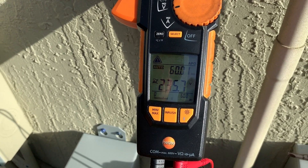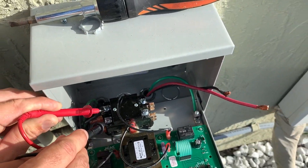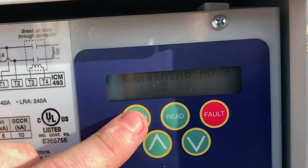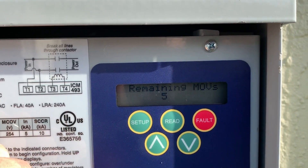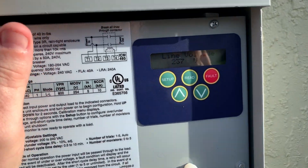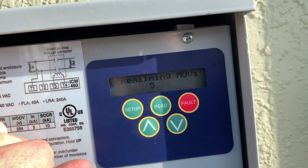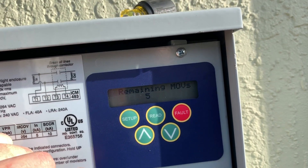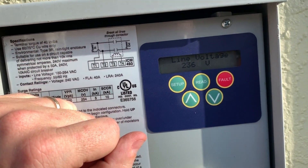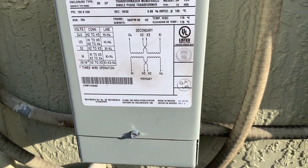There we go — now we are right at pretty much rated voltage. This unit is rated at 230V. We left it disconnected just to make sure we were going to have the proper voltage before we fired it up. Our line voltage is now 237V. We've got our amp clamp on it ready for a run test. 237 is much closer to rated voltage and now it gives us tolerance both ways. We have this set up to plus or minus 10%, which puts us in much more stable ground as far as the rating of this Carrier VNA8. That's it — using the buck and boost transformer. Thanks for watching.